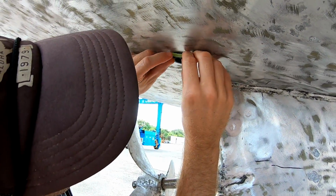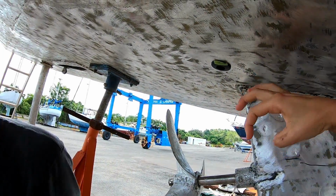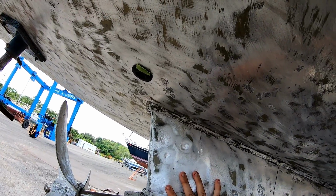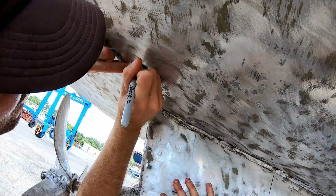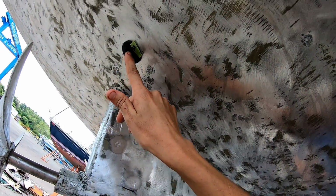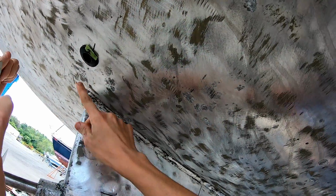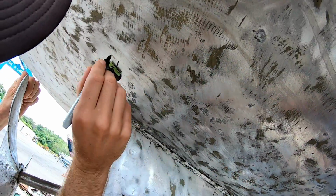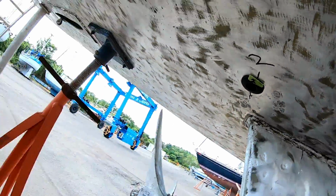in a way that when we go to fit it for the final time with the 5200, our little ball valve will actually be sitting perfectly where we want the handle. So this is going to be number 2. So he's going to put a 2 on it. And then he's going to mark where our little lines are so that we know. I would maybe even just mark both sides, babe, in that way. Yeah. And then number 2. Cool. And then we know the 2 lines up with the 2 and we're all good.